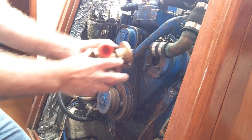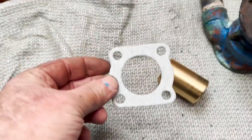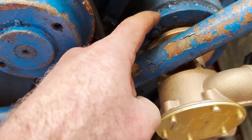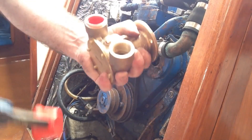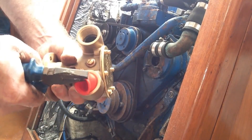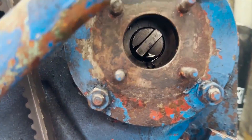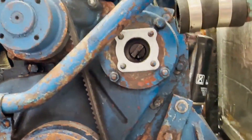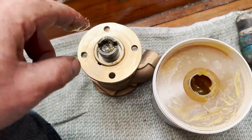Just have to adjust that slightly so it fits into the key. What I'd forgotten to do was add the gasket — there's a gasket in the box. There's also an alignment tool for the adapter plate: if you remove the adapter plate, you use the alignment tool to realign it. Taking out these little red plugs — I don't need those. There's glycerin in there already on that impeller, which is ideal, because I don't want to take that apart. I'm going to put the gasket on. I'm not sure which way the gasket is supposed to go, so leave a comment if I've done it wrong. I'm also going to put some grease in there — I don't know if that's important, but I'm just doing it anyway.